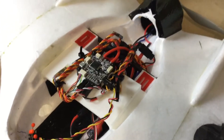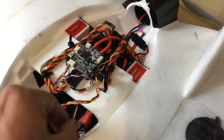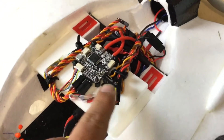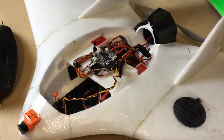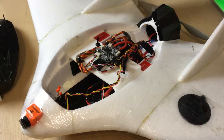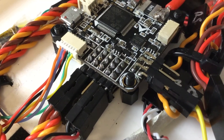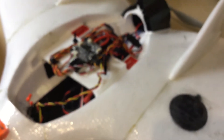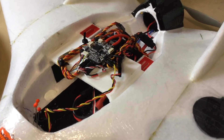A very quick video because it kind of looks scary but it's really simple. We've got two servos, the ESC, the control line for the ESC, SBUS in, a couple of wires going to the GPS unit, video in, video out, and a couple of power lines. I hope that helps — it might look complicated from face value but it's really, really straightforward. The hardest part of this entire job is soldering the little pin connectors onto the board itself. The rest of it is all just working with the interface in iNav, and when I get around to making the full-blown tutorials, it will be as simple as copy and paste.